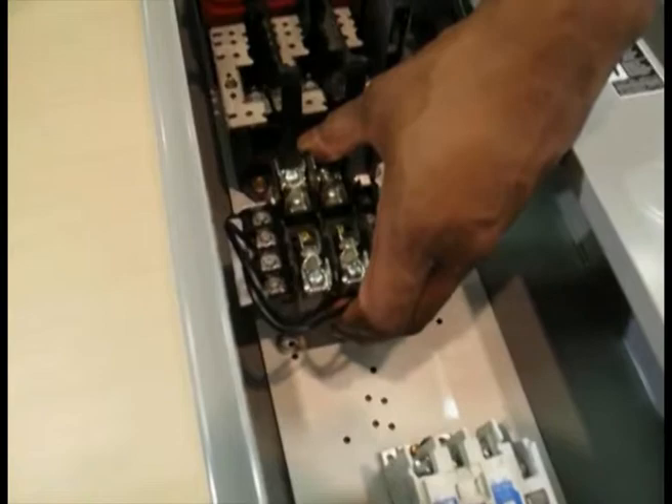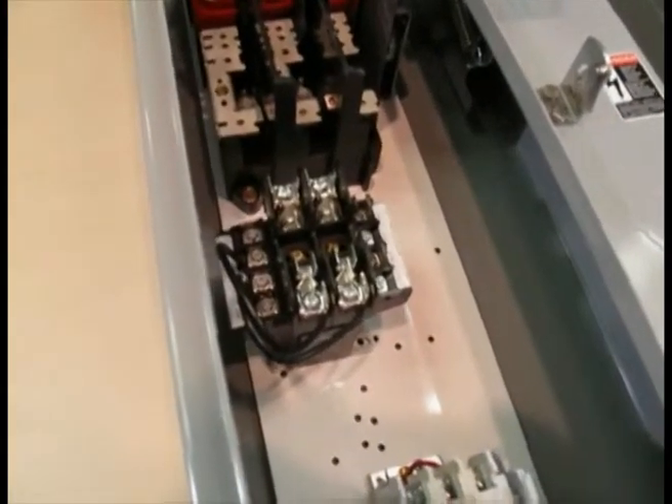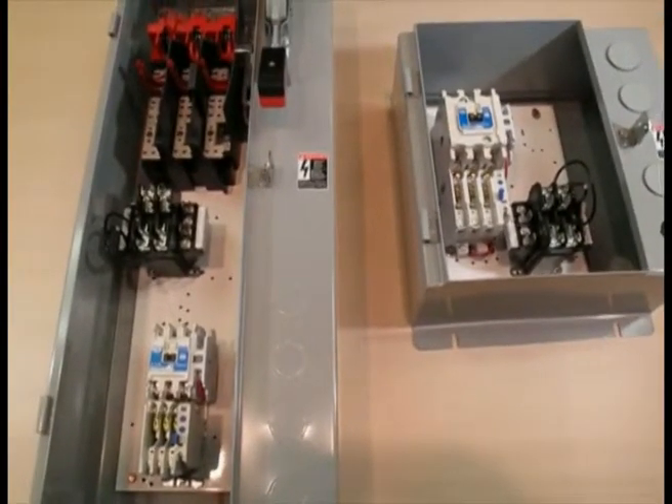Overall, the location of the CPT will vary on the type of assembly and the size of the box. But the most important rule is to locate it where the mounting holes on the panel match the mounting feet of the CPT. The end result is catalog number ECN 1808CAA.